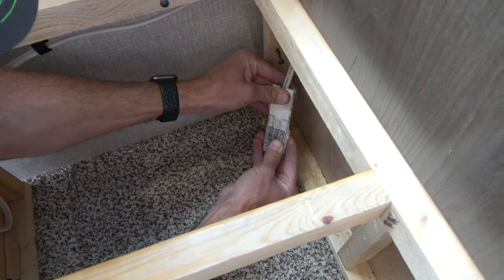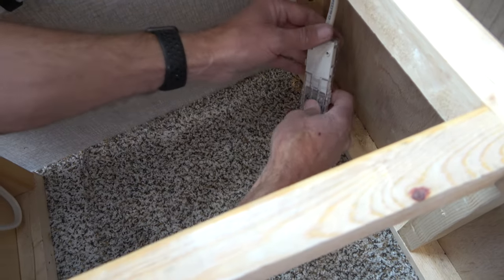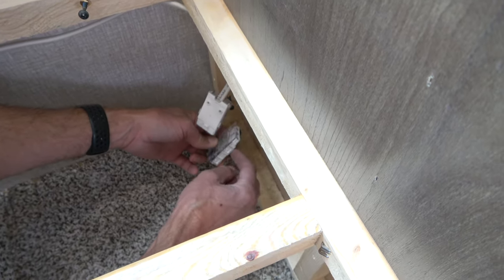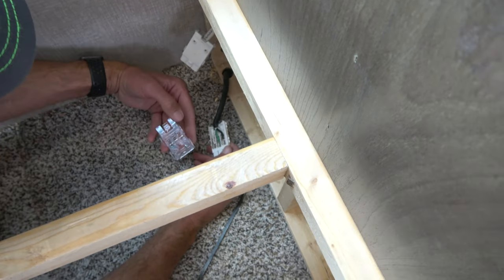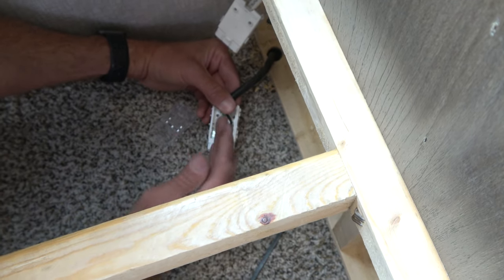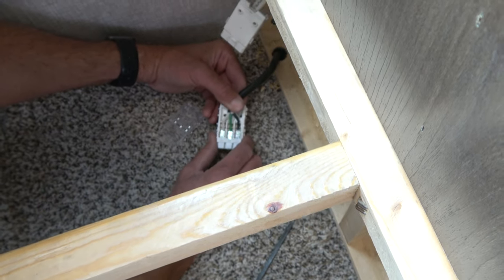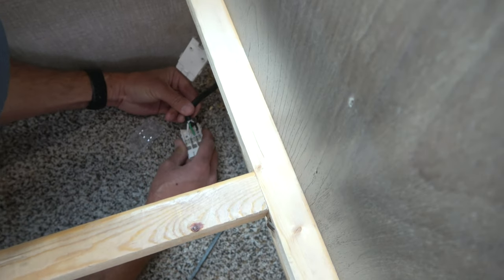This is what we found here — behind a piece of paneling back here covering this up. This goes to the outlet over here, and all that holds it together is this little clip. I got to take this whole plastic piece off; it looks like there are four little clips on the side I need to loosen up. These connections are pretty wild — this is how all the RVs work. They just push these wires down into the receivers and it slices the wires, even with the wire coating on it. You don't strip the wires or anything, just push them down and it makes the connection.